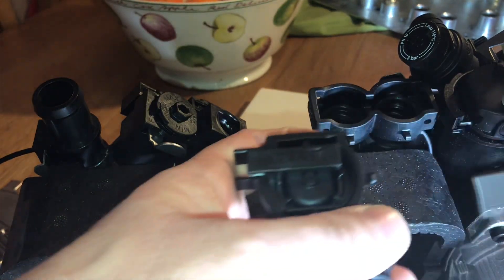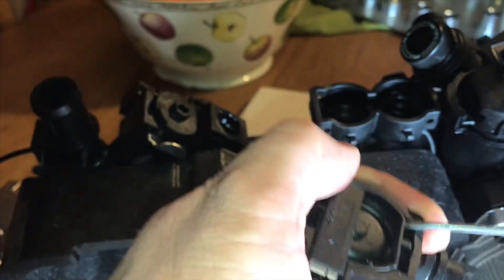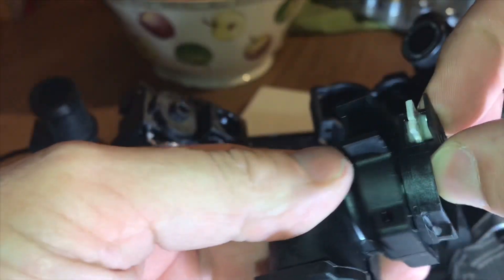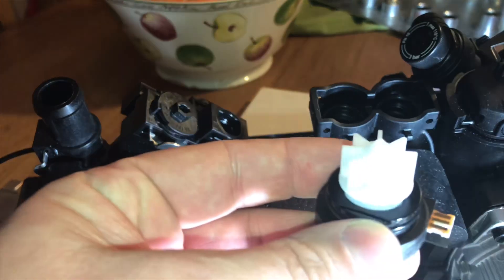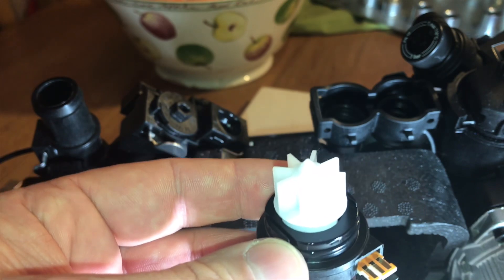It spins when there's a hot water demand — it's a very popular aqua sensor. Inside we have something called a Hall effect sensor. How Hall effect sensors work is they get 5 volts supplied to them. There's a magnet inside, and when that magnet spins it conducts electricity across from one terminal to the other using magnetism. So 5 volts is supplied and about 2.3 to 2.4 volts returns back.